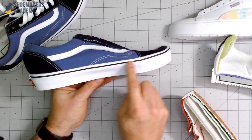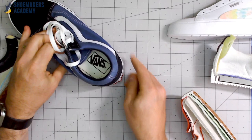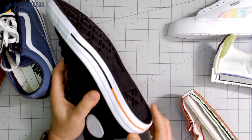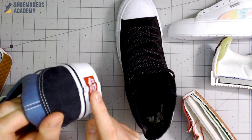This component is made of a few different pieces of rubber tape — it's actually a double layer, because this tape with a strip on it is a third piece, and then the little license plate piece is glued to the back. That's why on a vulcanized shoe you might see something that looks layered — that's where the tape overlaps. Sometimes they don't show the overlap: on a Converse they've actually butted the pieces together so the tape wraps around and the two ends just touch each other. Versus the way Vans does it, the two pieces overlap each other — it makes a big bump, but that's actually the style.